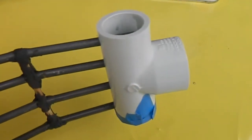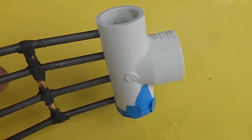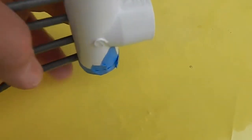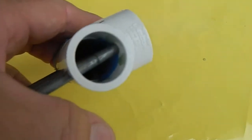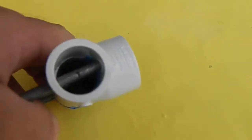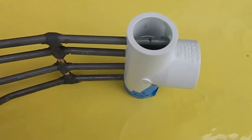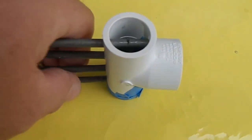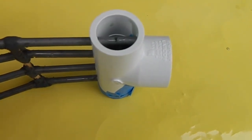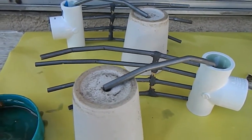But one other quick note that I wanted to make while this is drying: you'll know when it's done, or when it's working to be done, because the area that has the epoxy, the area that has the fiberglass, will start heating up like an oven. Probably get like 100+ degrees that you'll feel. So you might feel the metal get hot from the heat. I'm not sure if that's enough to generate to come out, but it gets hot when the fiberglass resin is curing.